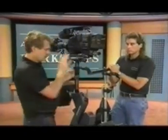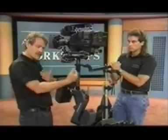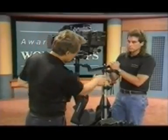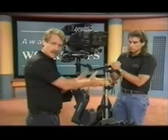Okay, I'm just fine-tuning the static balance here before I go into dynamic balance. You want to get everything nice and straight, perfectly level, perfectly good side to side. My assistant John is helping me by holding on to things. There's a lot of pressure out on this little arrangement for the spin balancing, so you always want to have somebody else there